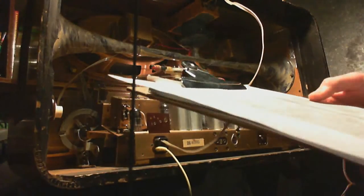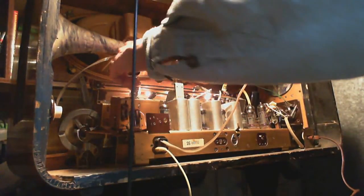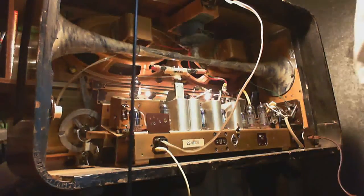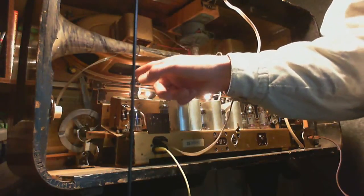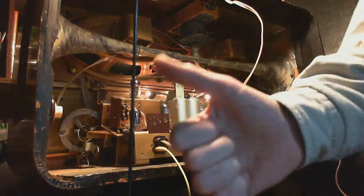So, okay. So ECC81. Yeah, I'm going to study this because look at it. This is a monster to try to go through on screen with you there. But I think it's a great observation. These two tubes have got no heater current. That should be fairly easy to sort out. Pretty sure. So I'm going to study the schematic and figure out why would two tubes not have any heat. Two is great. Two really indicates there's something going on in the radio. If one of these wasn't heating up, it would suggest it's the tube itself. But do I remember right? I think I tested this tube. That's a good sign. Hey, I'm loaded with hope.